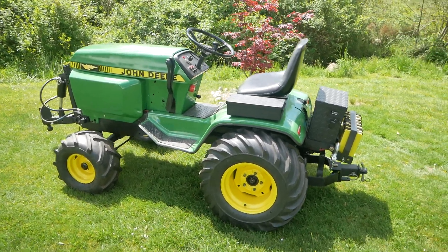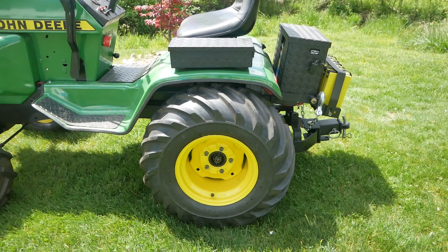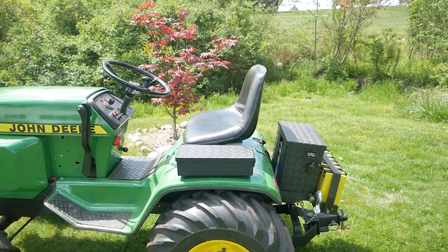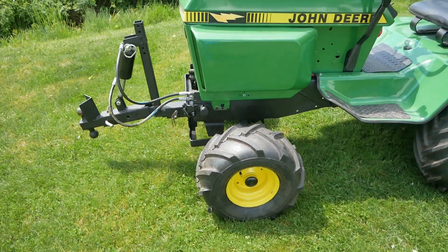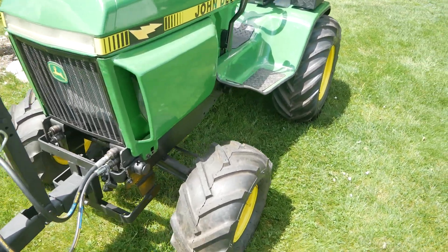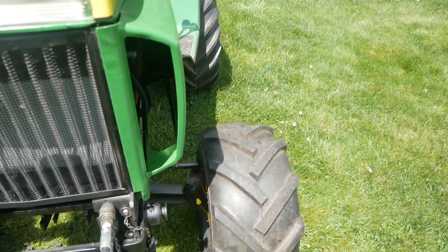Let's start with wheels and tires. These are 26 inch tires. I lifted the body one and a half inches, which I had to do because there's a battery under the seat. The front tires are 18 950s — they're so fat and so wide that I had to build a couple of spacers to get them away so they weren't rubbing on the steering mechanism.